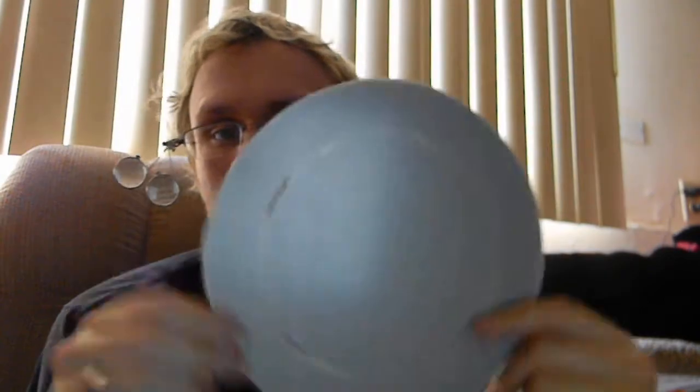And when that plastic recools down, it's just going to solidify right back into place — you just cut and you just wasted a whole lot of time. So even if you have to cut a little bit at a time, you go around, go around, go around, deeper and deeper until you get all the way through. That's what I was doing.